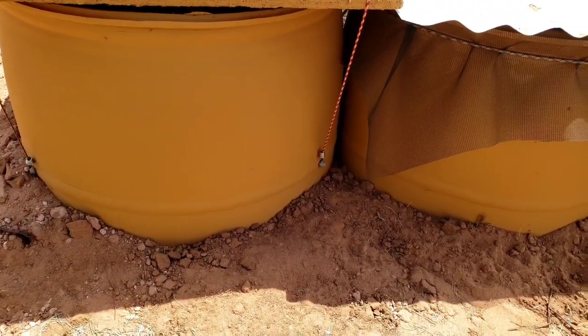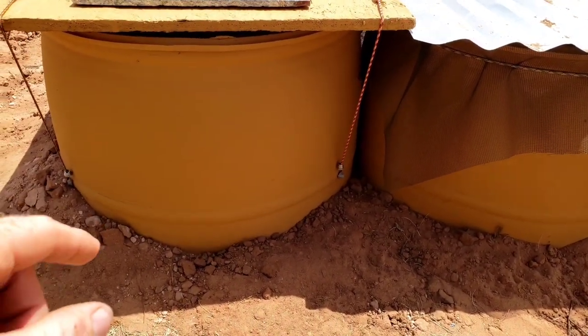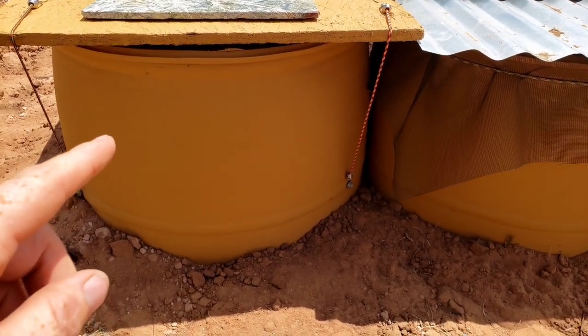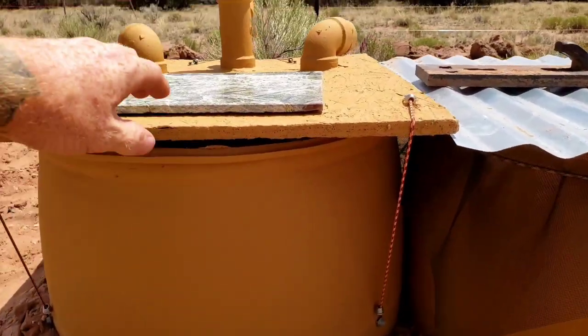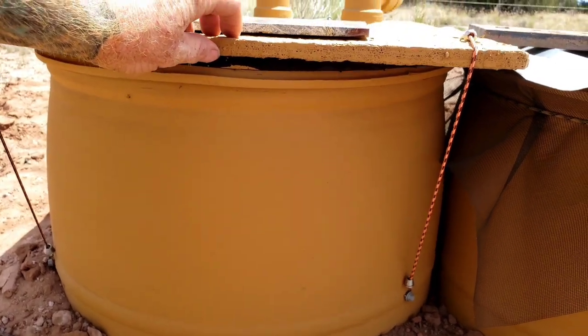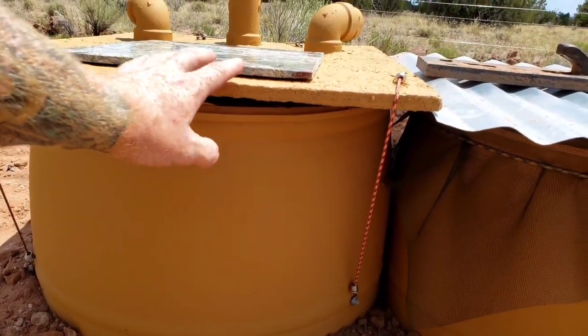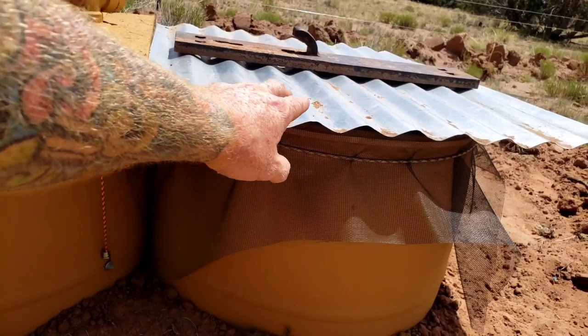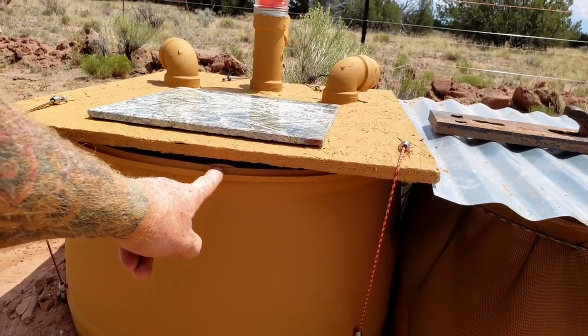With that explanation from the state of Arizona, let me give you a quick rundown of what's going on over here with the toilet barrel composting system. I simply have two 55-gallon plastic barrels. I dug down into the ground to make sure these were not more than 16 inches above ground and not less than 12 inches above ground — that's important to pass your inspection. You also have to have a gasket between the lid you create and the barrel, and this gasket is attached to the lid. When I move this lid from the active barrel to the other barrel, I can lock it down using bungee cords and seal out any insects.